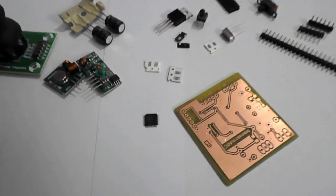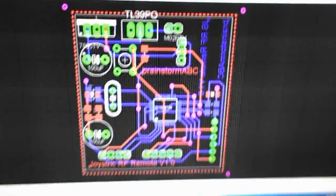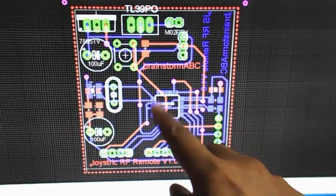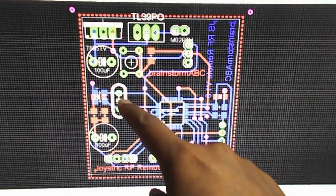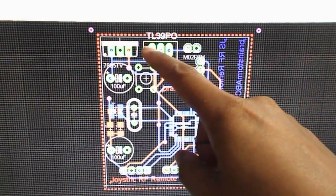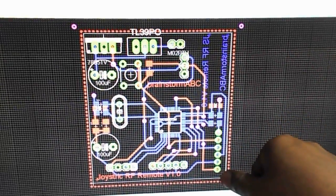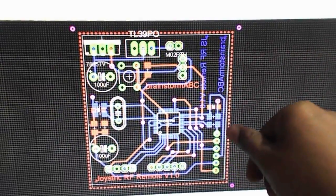We are going to make our own, so we have a microcontroller — the ATmega8 — and some other components to complete this project. We have developed our own PCB with that. On it you can see the microcontroller, crystal, some capacitors, LEDs, a 5V voltage regulator, a switch, and some connectors. We have also included an ICSP programming port.